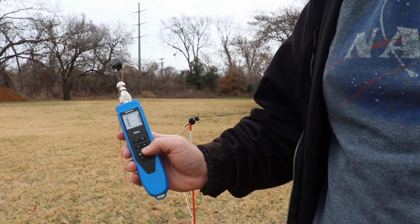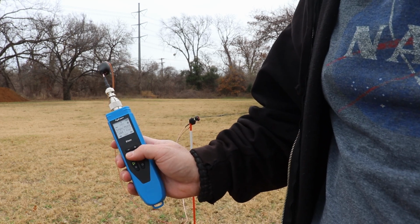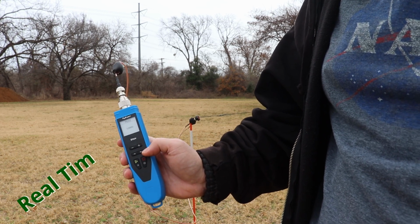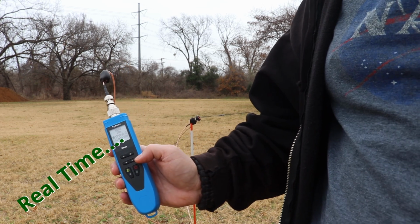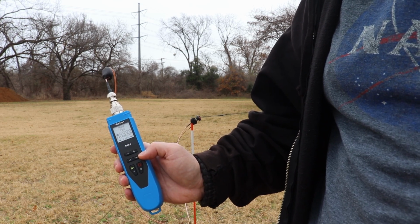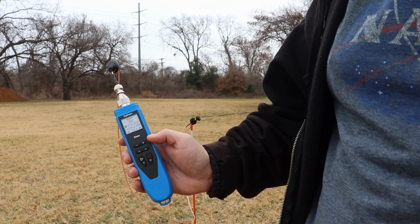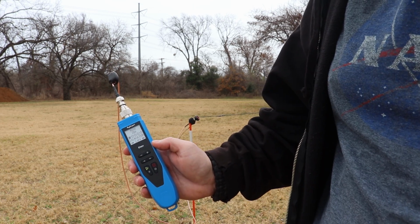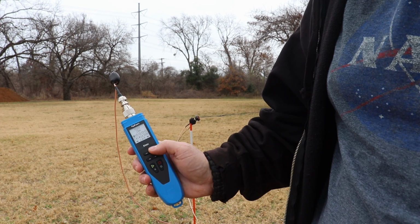Since this is a random wire, let's go ahead and go back to the home screen and tell it to scan multi. I misspoke here, so let me tell you what it's actually doing. It's scanning all the frequencies that it has access to and only going to display the ones that are the best match for your antenna. At 20, we're still at that 2.41.